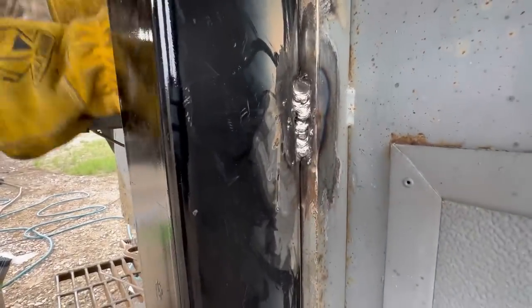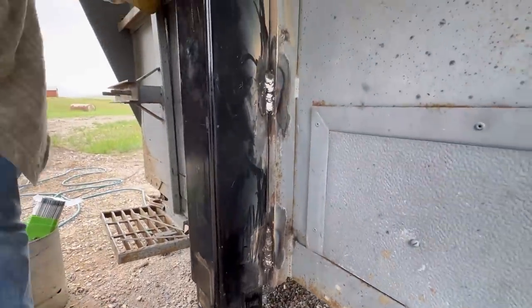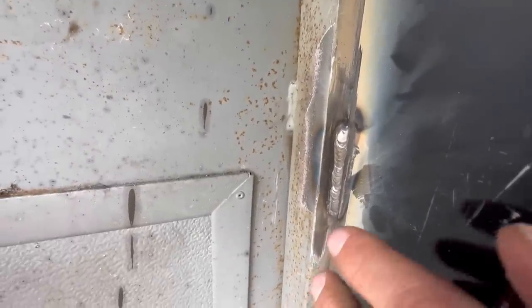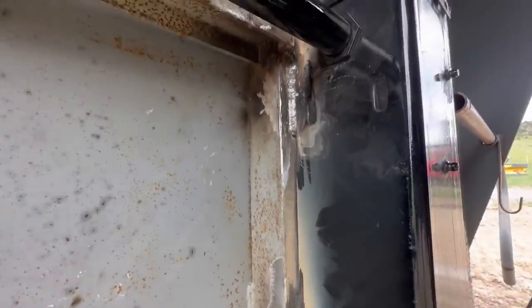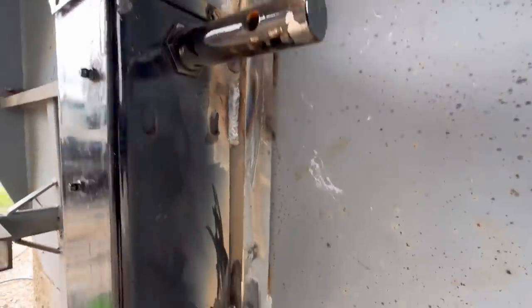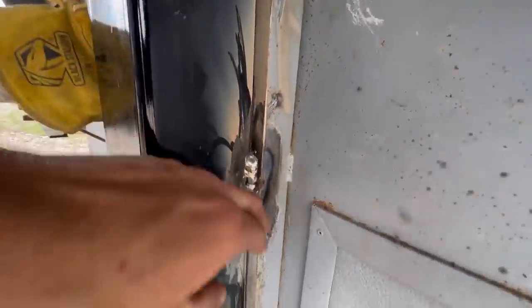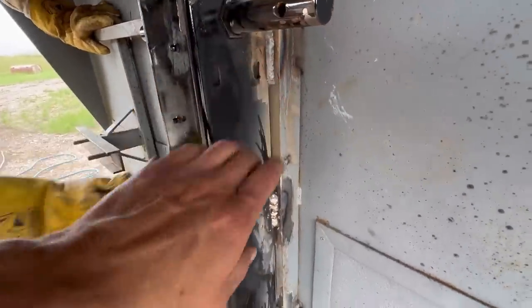So here's Emily's two welds. Not perfect, but they'll hold. I'm not worried about those going anywhere. The trailer jack's not just going to fall off. And then over here, this was the Polaris A. This was also the Polaris A. I have a little work to do to really get this figured out. I think the waterproof coating they put on the Polaris A is what makes it a little bit different of an arc characteristic. And then there's my 7018, looks pretty okay. And then that was Polaris as well right there. So this is all 7018 Emily worked with because she's familiar with that rod. But we're going to get this thing cleaned up, and then we're going to paint it.